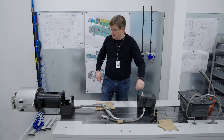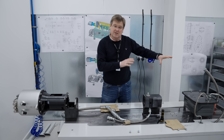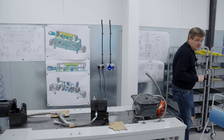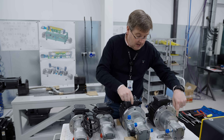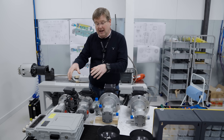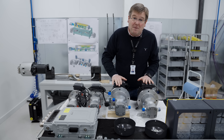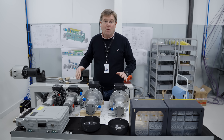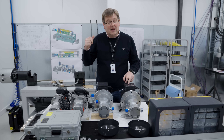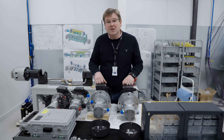The two gearboxes are mounted up here through these couplings. This is the high-speed drive motor designed to spin the gearbox at 35,500 rpm, and all of this has to be balanced. Underneath the rig we've got a series of pumps to drive the oil and then scavenge pumps to bring the air-oil foam back out of the gearbox into an air-oil separator and return it to tank. These are all very big because we don't care about weight on the test rig - we just want a steady supply of pressure. We qualify exactly what we want and then put tiny versions of these in the accessory gearbox.